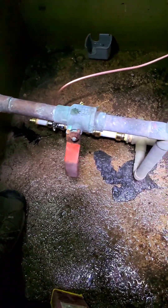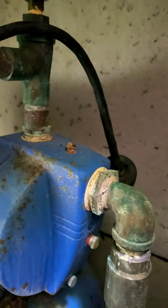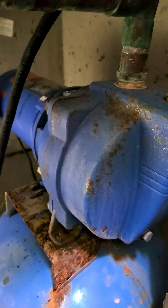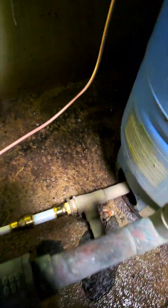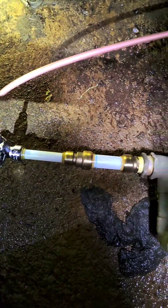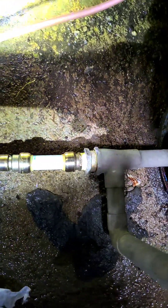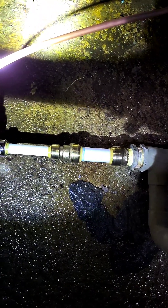City water is coming in — that could be your well going up into the intake suction for the impeller of this shallow water jet pump, showing about 60 pounds coming out and down into the well pressure tank. Here's our new PEX setup: a 3/4-inch MPT connector into 3/4-inch PEX pipe, a 1/2-inch reducer, a 1/2-inch T — I wish they didn't have it in chrome but that's what was available — then an end cap I'll put a valve on eventually, and then 1/4-inch copper tubing up into the pressure switch, and from there it comes back up into the house.